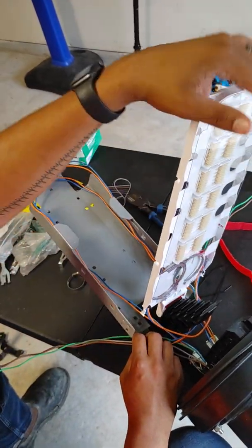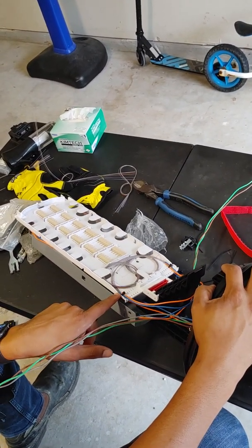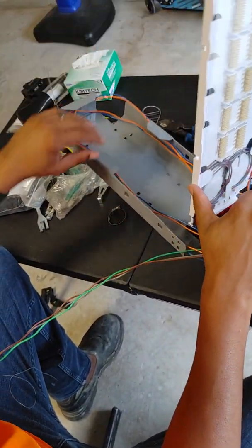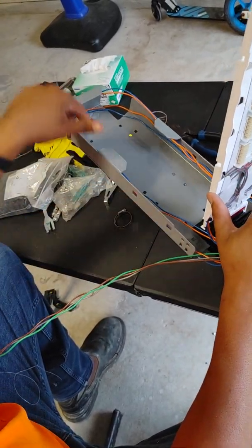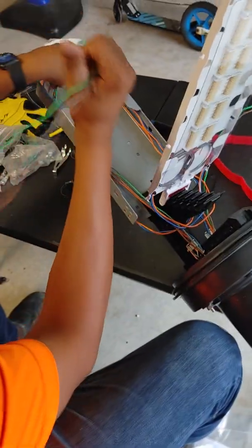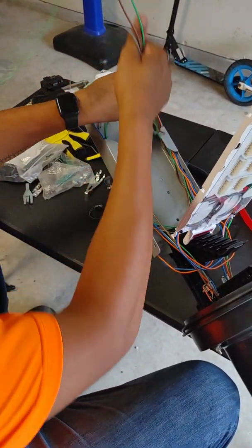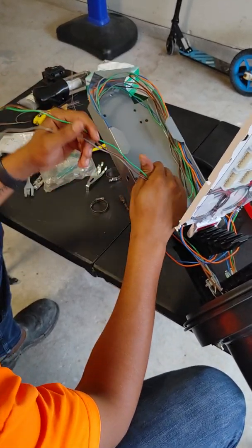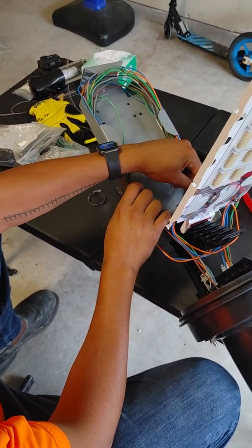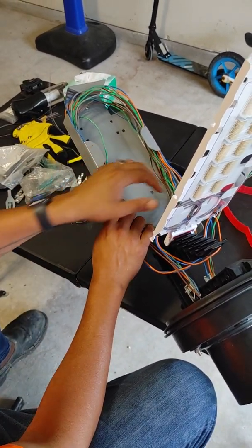We measured it with these points rather than with the tray in. If you see right here it lines up — if you go up a little higher you might need a little less but generally it's okay. You just want your slacks to look nice coming all the way in and out, nothing short in between, and then you lay all your dead fibers on top. It's important to lay dead fibers on top because when somebody gets back in here and needs to use another buffer, they're not fighting with something they can't remove — it's all on top so they can pull everything out without messing up anything else.